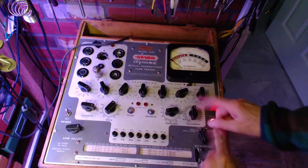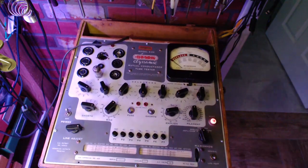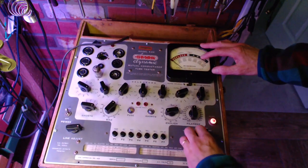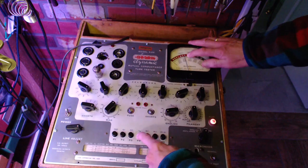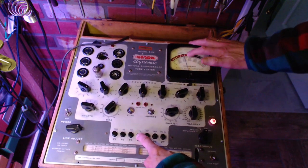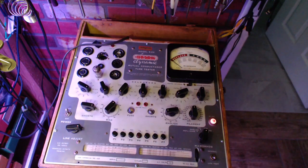Okay. Here we go. Expectations, this one will be weak. And ECC 85, 2580. 3000 scale, 2580 is way up here. Could be over 4000. I'm on the 6000 scale, 25 is right here. Oh baby, again, another tube on the reject point. If this were a good one, this test would come up closer to 4100, which is way up here. A number of weak tubes in this radio.